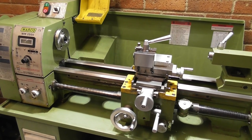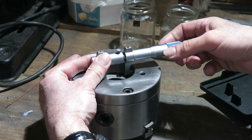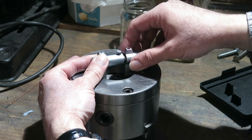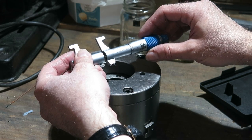With a bit of luck, the backplate that I'm about to make will stop this happening again. Crucially for this to work, the diameter of the bore on the backplate has to be a really nice fit with the flange on the lathe spindle. And to get the diameter for the backplate bore, I'm going to use one of the chucks that came with the lathe as a reference point. So now I've got that measurement, I can start cutting some steel.